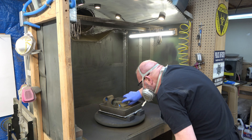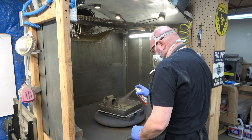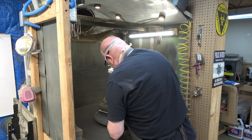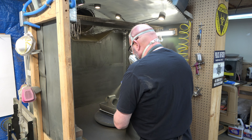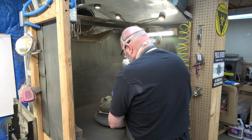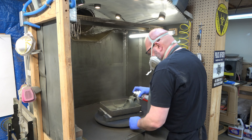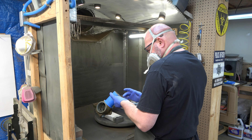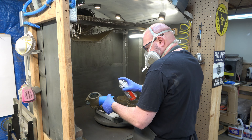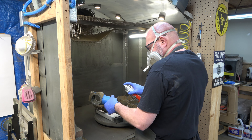But once we're done with that, we'll go ahead and do the table first. I'm just spraying the primer up inside that bore to get as much of that area as I can. When it's a piece like this, I'll prime half of it, let that dry, and then come back and flip it over and prime the other half. The primer only takes about 15 minutes depending on humidity to dry. But I've gotten to the point now where I let it sit for probably about a half hour to an hour before I come back and flip it and prime the other side.